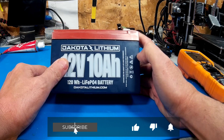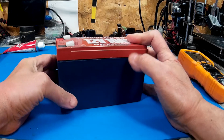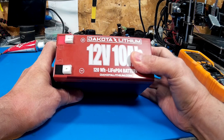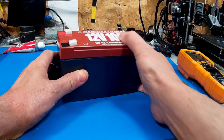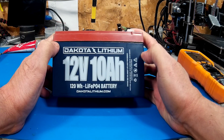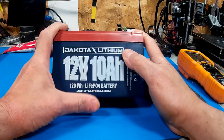Right off the bat, from what reviews I've seen on this battery, kids are buying it for their little scooters, running them in series, and they are working — but if they pull more than 15 amps, they cut out. Now I don't know if that's because the BMS is set that way or if it's thermally throttling the battery because it gets too hot.